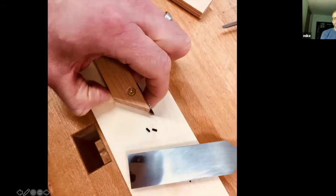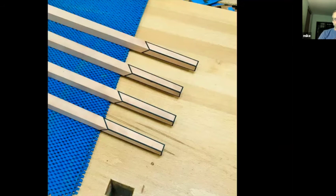I would use a Japanese pull saw to make rough cuts, and then to make finish cuts I used essentially a manual miter trimmer — a piece of beech with complementary miters cut on each end. I hold the piece of edging on one of the long faces of the beech and then the back of my chisel is guided by the miter cut — it's like a manual miter trimmer if you're familiar with one. And here are all four legs with the inlay and edging done and flushed off.